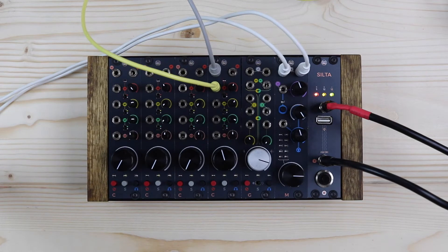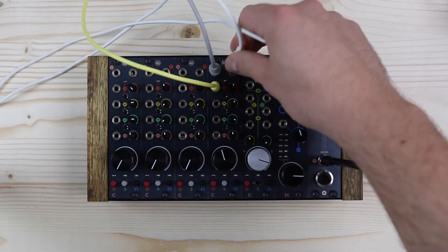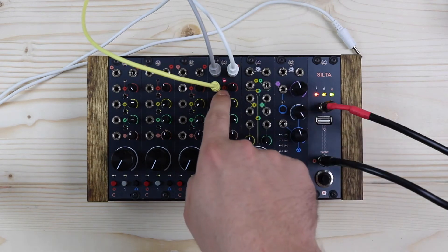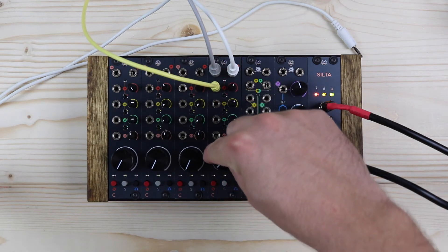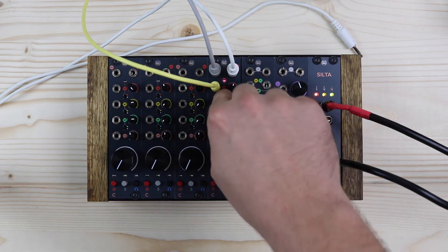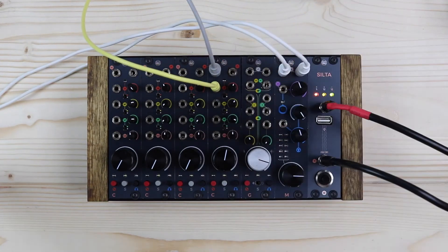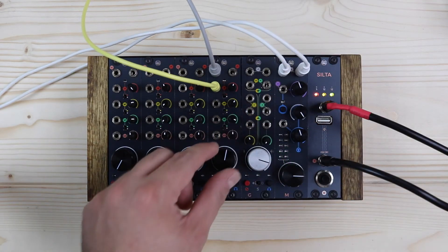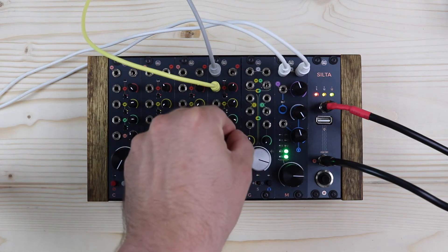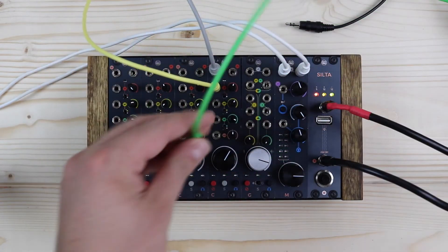After the main VCA, the audio is sent to four parallel destinations. The first one is the direct output — it is always post the main VCA, but using the switch below the VCA jack socket and the VCA pot, you can get the direct output signal pre-fader on the top or post-fader on the bottom, depending on what you need. The other two destinations are the two sends; we will see them when we talk about the group. The last one is the pan control, the salmon area here. The potentiometer always works as a normal pan pot, moving the signal from left to center to right. If any control voltage is patched, they both work as a pan offset control.